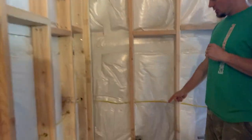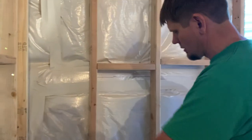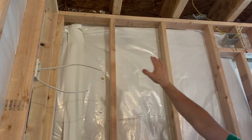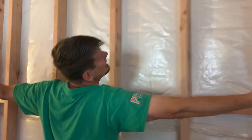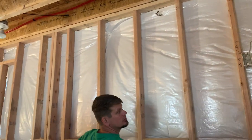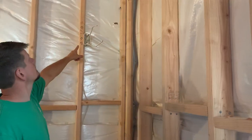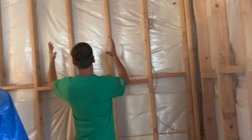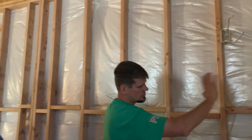Right here is going to be their little nook area for entertainment. Whether they put the TV here or there and plug in, they wanted the TV up high at a corner — they're going to mount it with a bracket arm. I told them to put it on this wall because later this is a beautiful wall for a gigantic LCD screen. We put the outlet at 80 inches, which is typically okay with 9-foot ceilings. The wall bracket mount will cover that outlet, so it's a two-for-one. This circuit is dedicated.